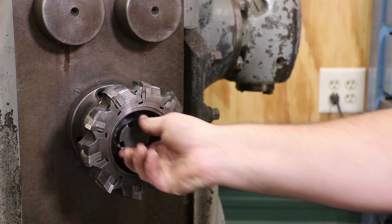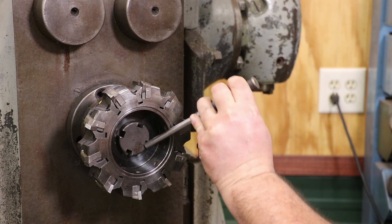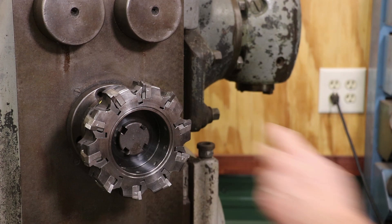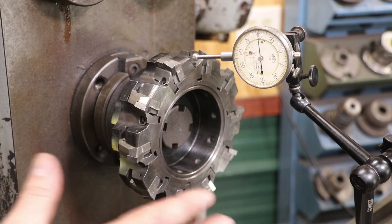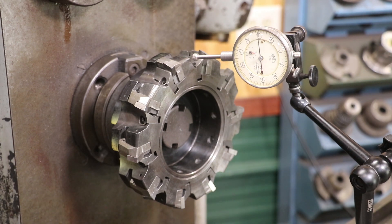I've still got to get this tight and I don't have the right tool. I've looked around the shop and for right now I'm going to cheat — I don't recommend doing this under normal circumstances, but sometimes you just got to do what you got to do. I'm going to take a punch and a hammer, and that should be fine. It looks like somebody's already done that on this corner to take it off. I'm going to have to either find or make the right tool at some point. Now I want to try to get an idea of how these inserts are currently set in here and see if there's any variation from one to the other. I suspect there probably is, and I also know these inserts have worn faces, so they're probably not all even anyway.